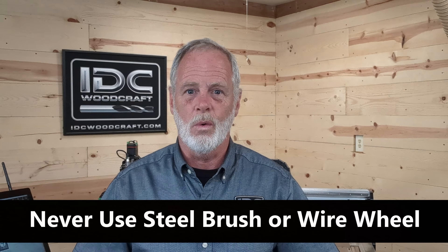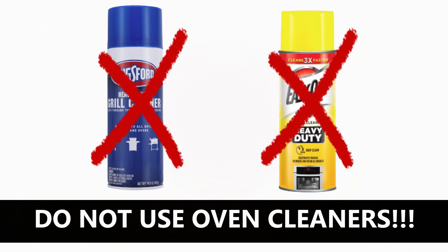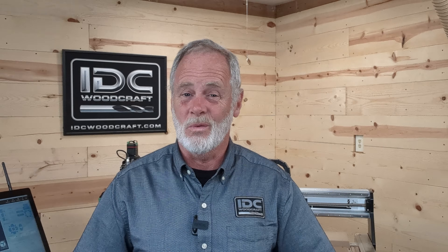Then take it out, wipe it off with a rag or a brass brush, and if you haven't gotten all the pitch off, put it back in. You never use steel tools to clean steel tools — like a wire brush, grinder, or wire wheel — because it's steel against steel and you're going to damage your tooling. Always use soft tools like a brass brush. Another cleaner you can use is a citrus-based cleaner: spray it on, let it sit for 15 minutes, wipe the tool off, and repeat the process until all the pitch is gone. One thing you do not want to do is use oven cleaner — oven cleaner eats away at tungsten carbide and will ruin your tooling very quickly, so never ever use oven cleaner.